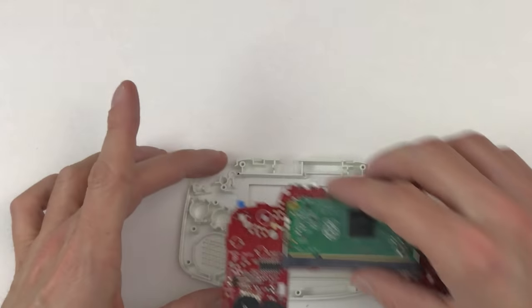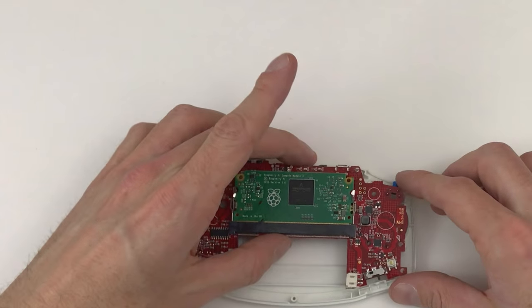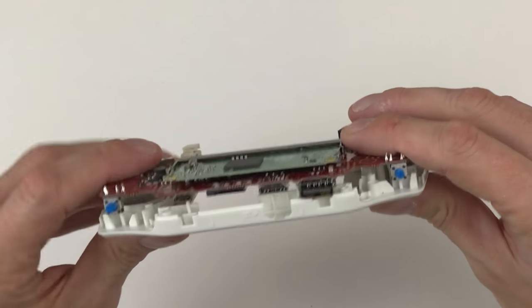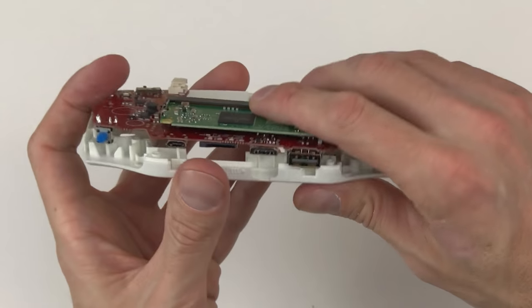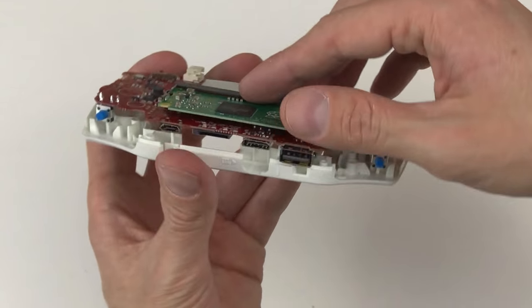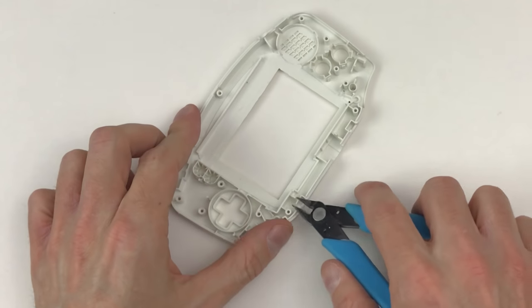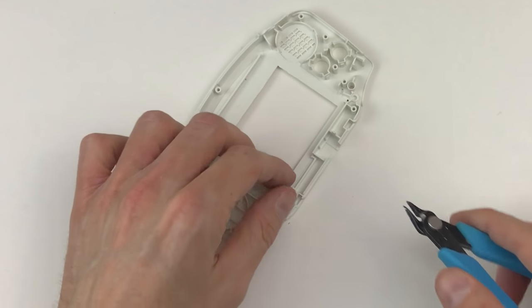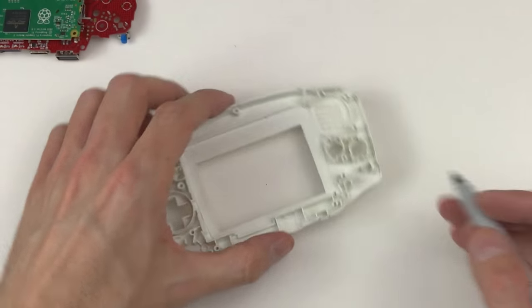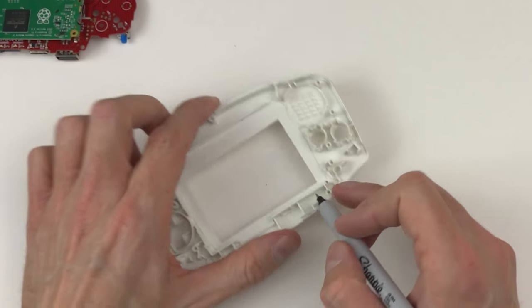Yay! Now for the ports in the front of the case. It's gonna be the same as the rear. We're just gonna step it down slowly, taking away a little bit, taking away a little bit, whatever is hitting. And fitting and checking and doing it again until it's all the way down. And I know I want to get rid of the wall behind the USB here.